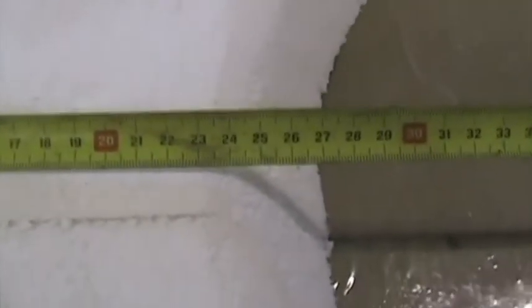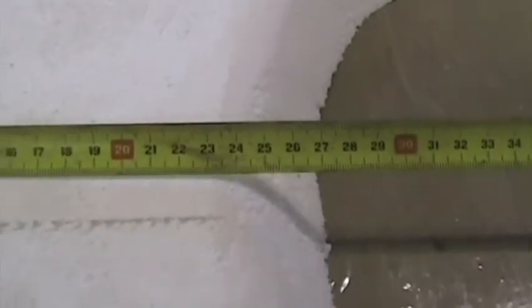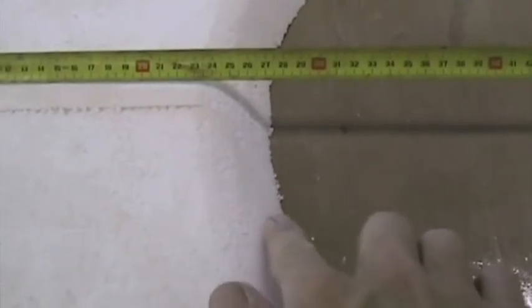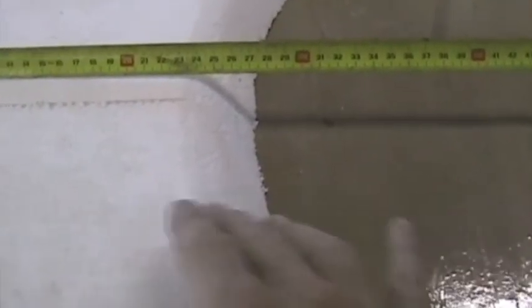And then the cutout, I've made 270 from the lower edge to allow this entire area to accept all the Teflon bushes that are required for the cable guide bulkhead. I've also beveled this inside face, and I'm going to lay up fiberglass over and down onto the table so that there's closeout on the inside of the bulkhead.